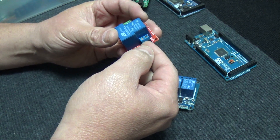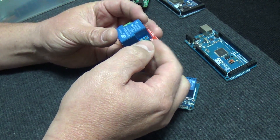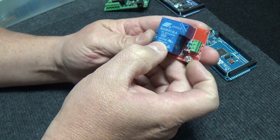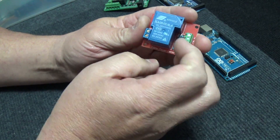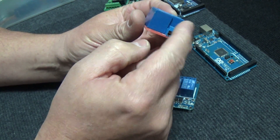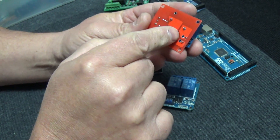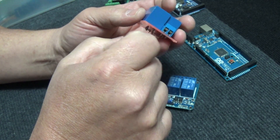The side that goes through the relay where you're making your connection is on this side. Typically you would want to switch your ground or your low side — you don't really want to switch power through these, though you can. This particular one is a 30 amp relay. I've used these on large motors and they do work, but for higher amperage, take off these little screw-in jacks — they don't work well. There are larger solder points on the bottom; definitely solder to those to carry the current across.